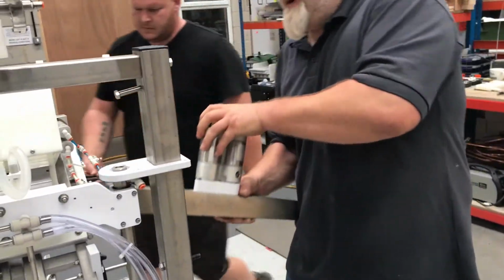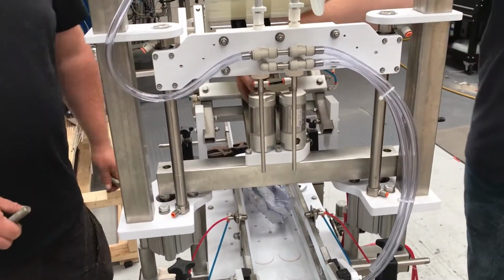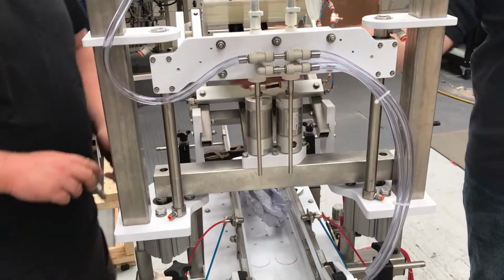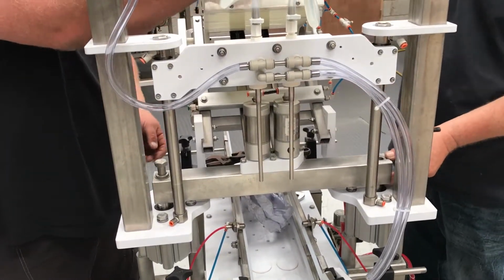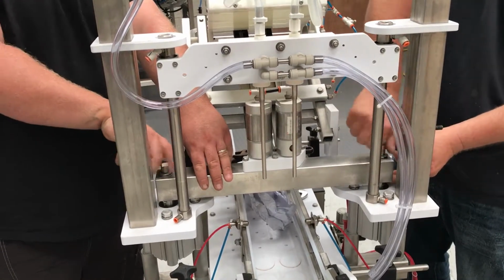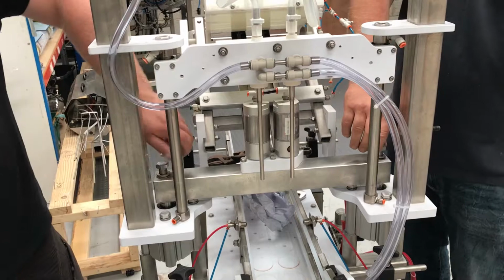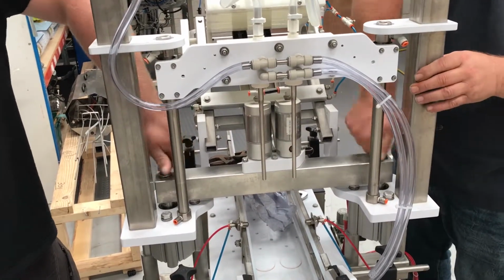Next, crowning bar back in. Check that it's pointing the right way. The open end is where the pipe work comes in. Again, just locate it, get it in place. And this one we're going to tighten up all the way. Make sure this is tight. If you look, the head still rocks a little bit because we've not tightened the bolts at the bottom. That is deliberate.